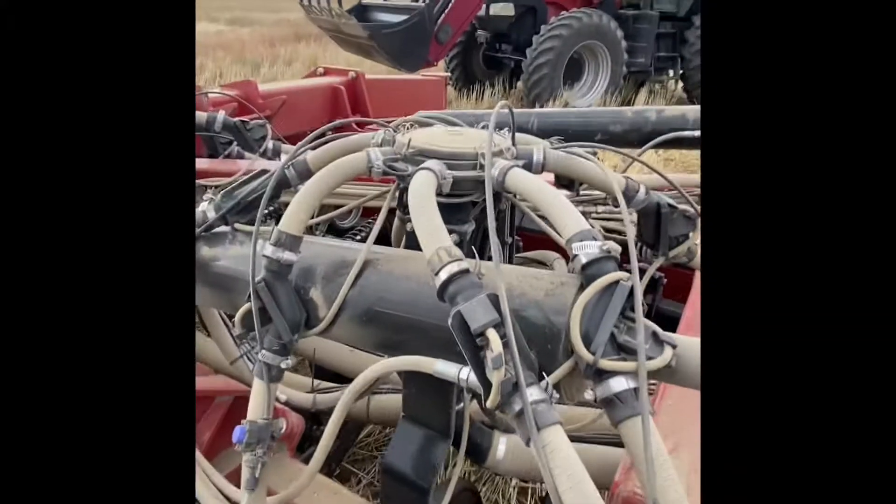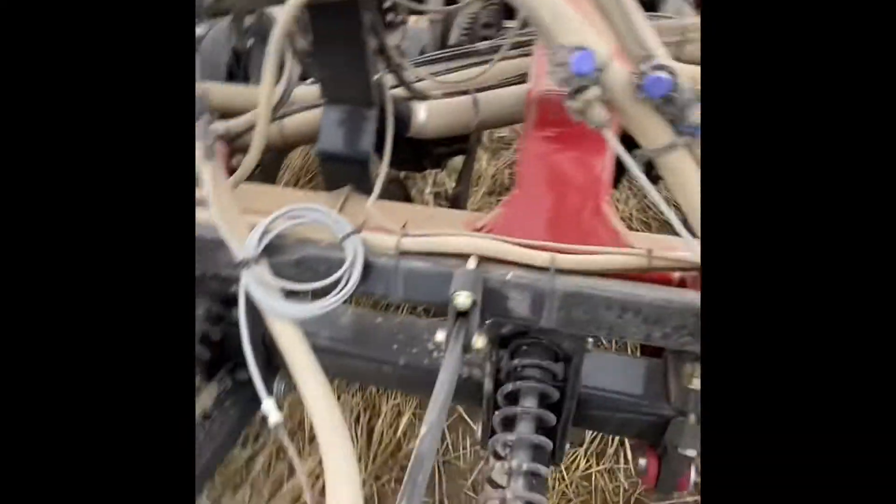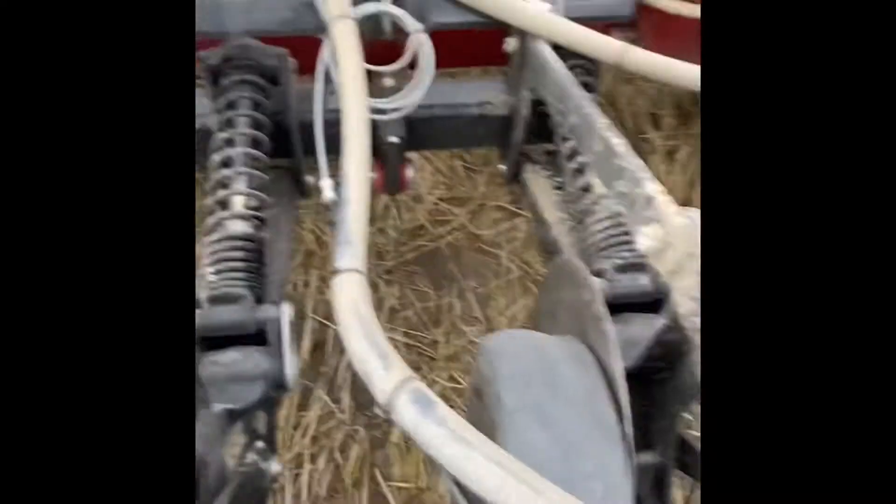Feeding out of that tower are all of these quarter-inch black hoses coming out of that manifold setup up there. Those hoses just follow the primaries down, and then we branched off each primary right at the tower and follow it out just like you would with the secondary hoses.